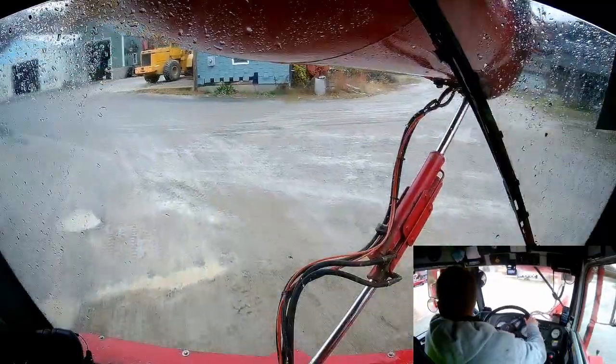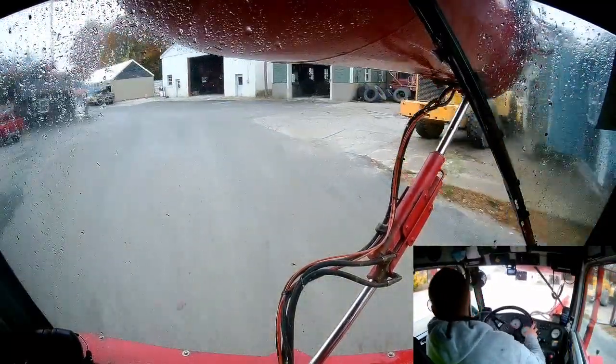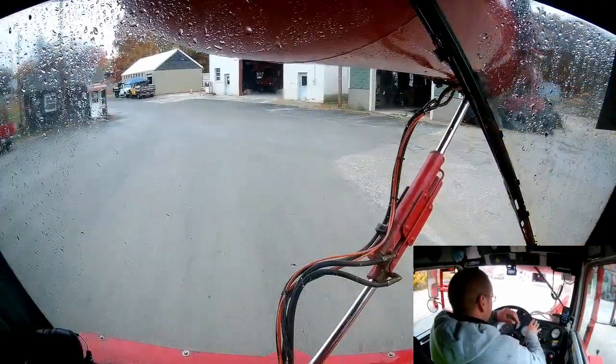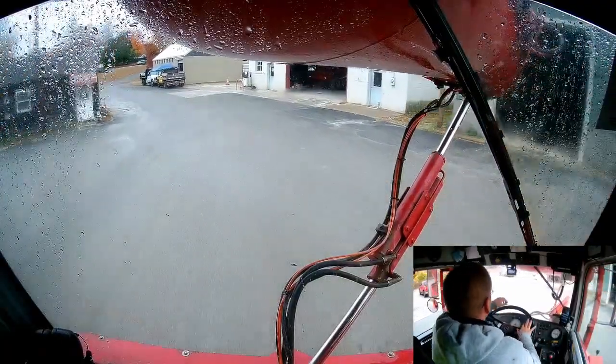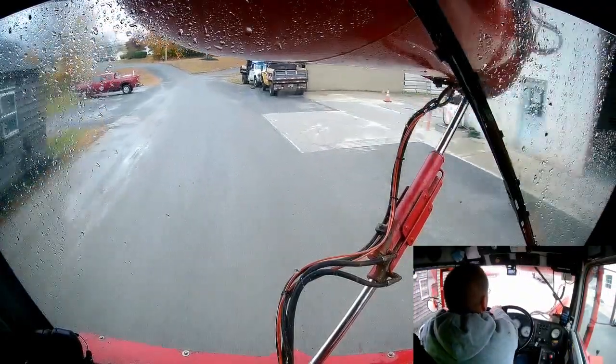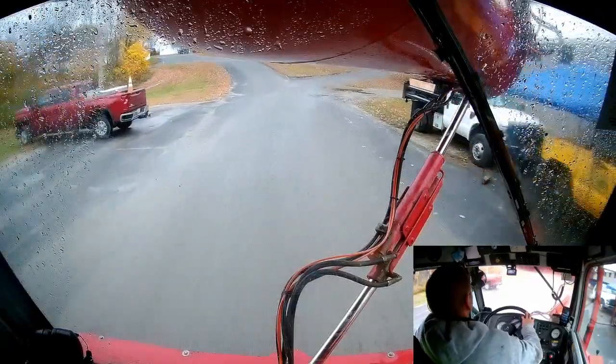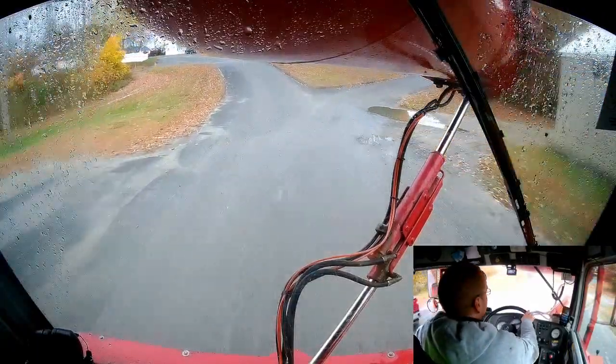a particular path, around here, the curbing that I'm most familiar with is the big granite pieces of curbing that get placed in the ground, and then they order concrete to either back it up. Usually you pour in the front, and you pour a little in the back, you just move on down the road like that.